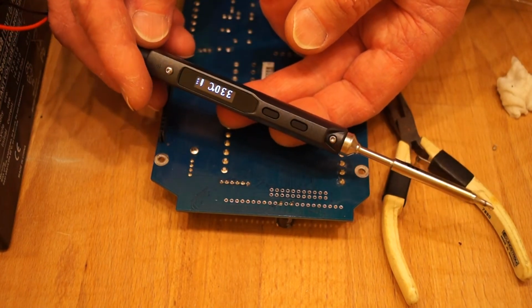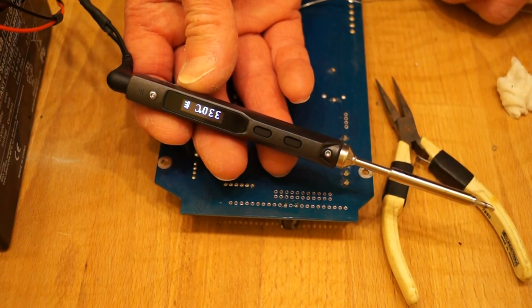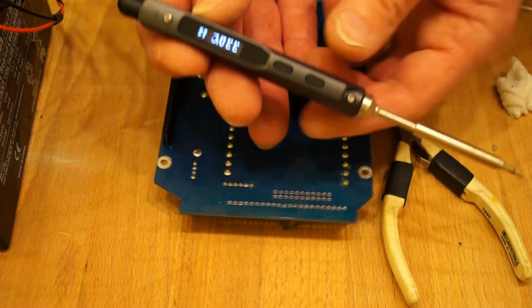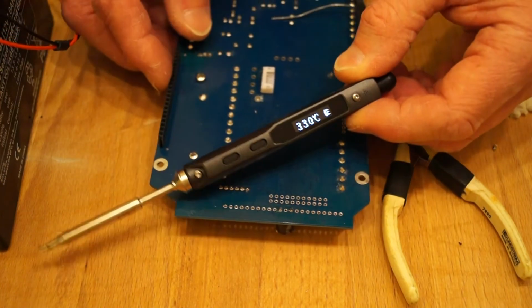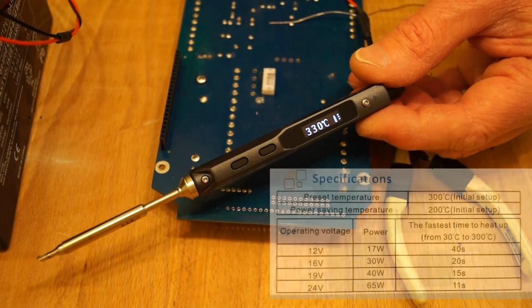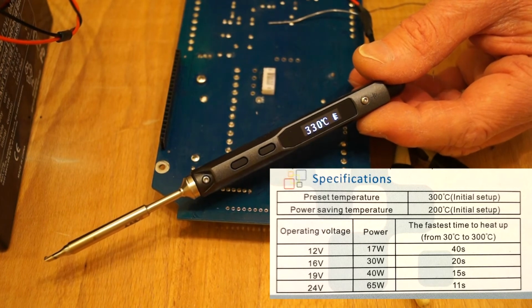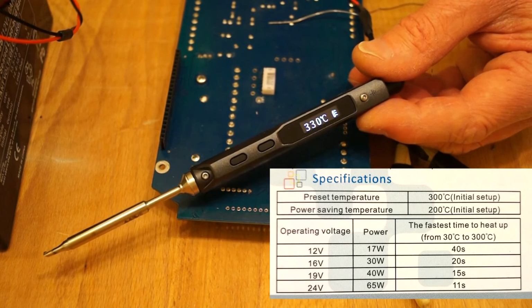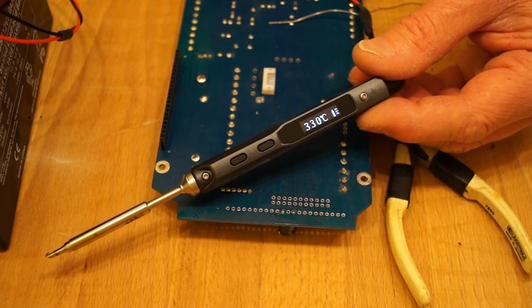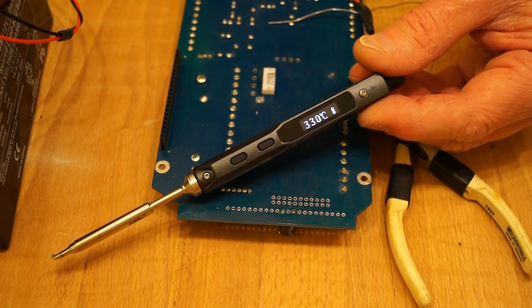Ideal for electronics. If you don't particularly want a larger iron, something you could take about with you, I think this would suit you quite nicely actually. So you could run it off of a laptop transformer. It runs anywhere between 12 and 24 volts, I believe, if I remember the instructions correctly, guys. But the little charger or transformer I was using at work only rated 3 amps, and that ran it up quite nicely, and we were doing some soldering at work with it as well.